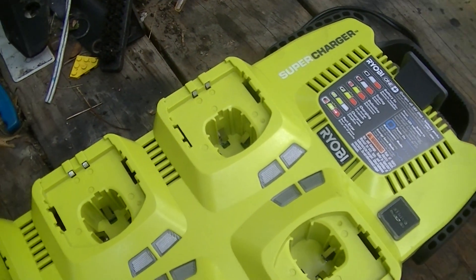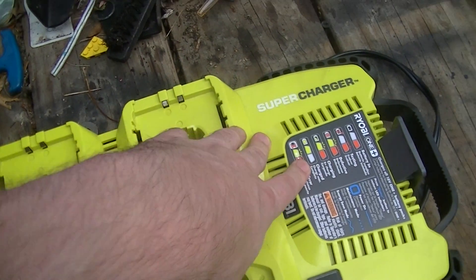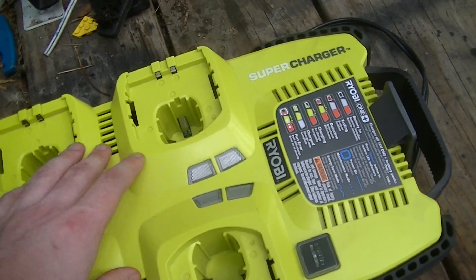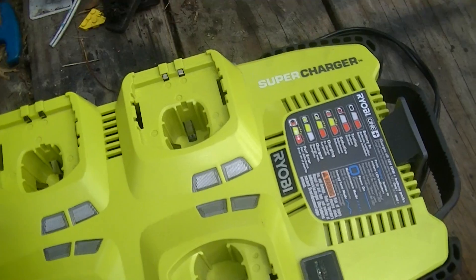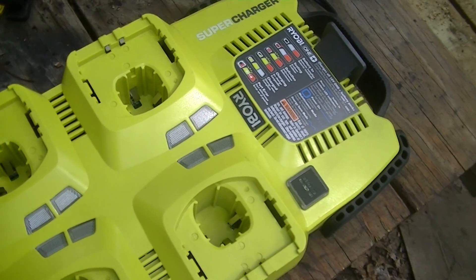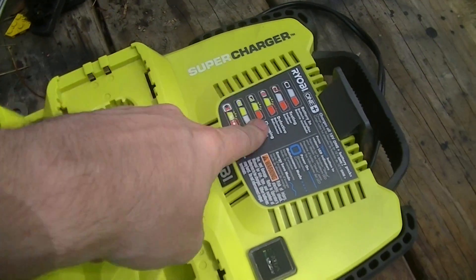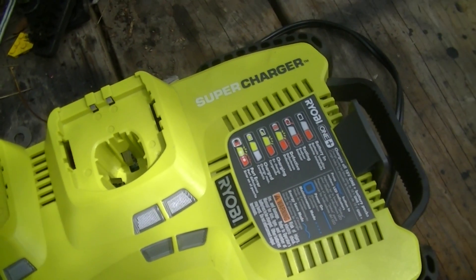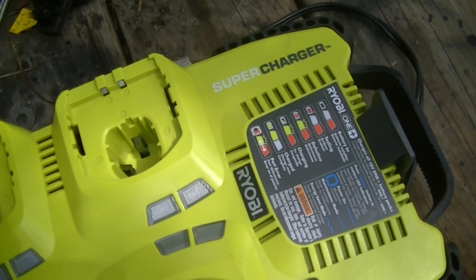85 watts would be a worst-case power draw scenario, but at least with the single-battery charger version of this, it draws in the 70-odd watt to low-80-odd watt range when it's charging a battery, because it won't charge more than one at a time. So what I may do — risk of electrocution, don't try this at home, know what you're doing, usual legal spiel — is replace that with a higher-rated device like a TOP268, which is good for around 100-something watts. Basically the main difference is the on-resistance of the internal FET: lower losses for a given power means you can run the thing harder, and it can handle more power for what it's dissipating.